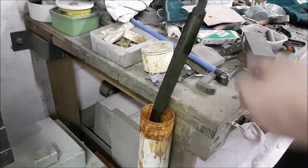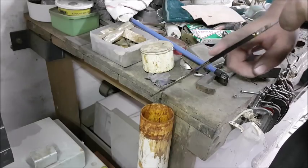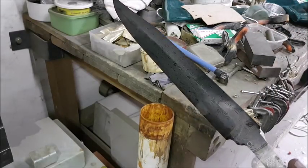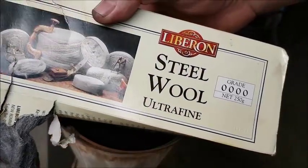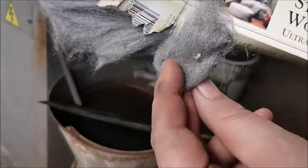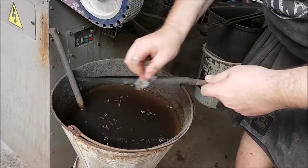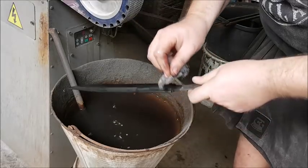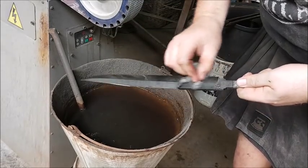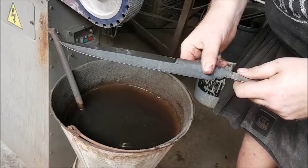At the end of the first cycle, I wipe the acid off and let it drip back into the tub, then take the blade and clean it off in a bucket of water. I use this steel wool — wet it and clean the blade. What we're doing here is cleaning all the oxides off — all the carbon steel that the acid has eaten away. We rub it off so we're left with a clean surface.